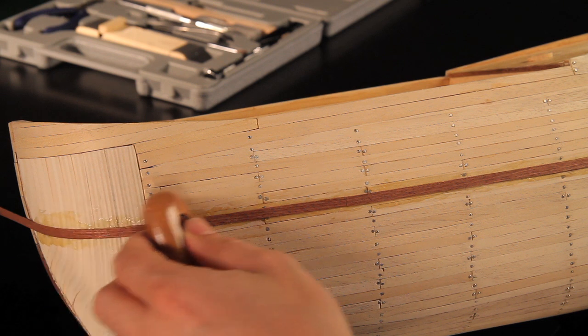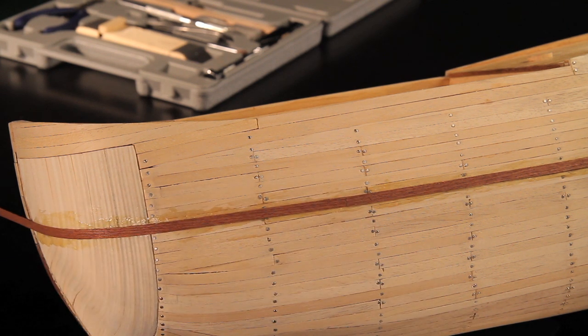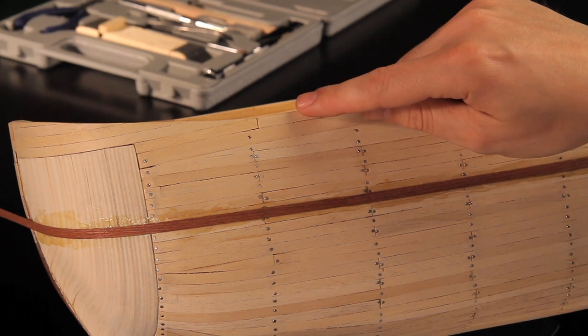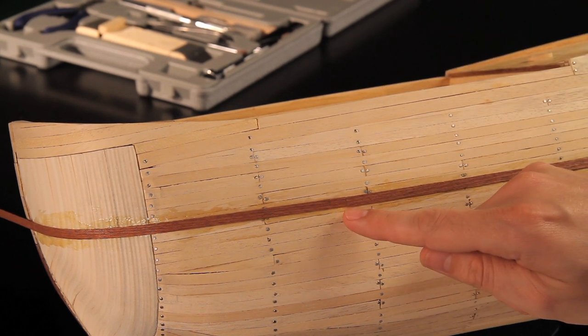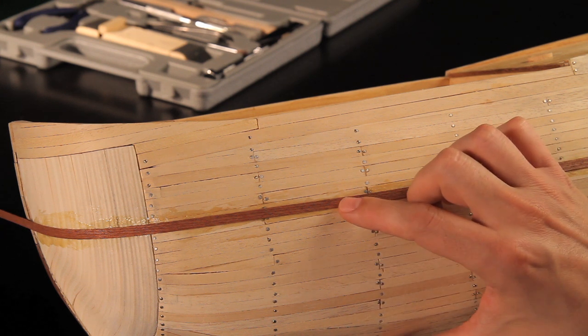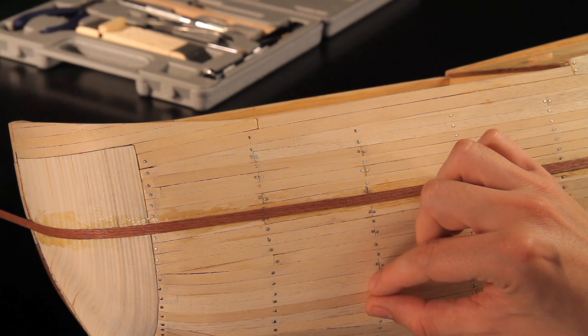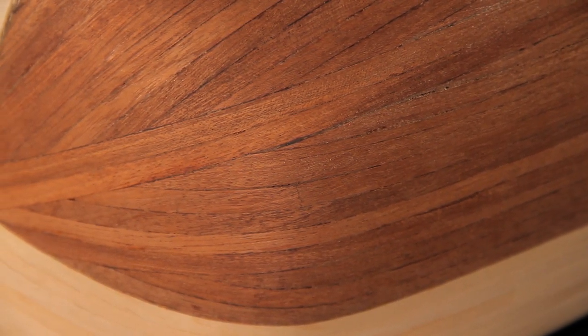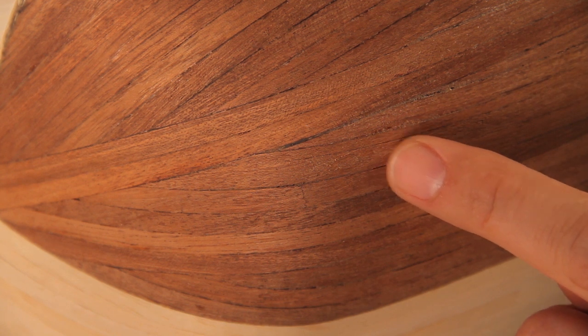Fitting the remaining pieces of planking is carried out in the same way as the first planking, from the first strake towards the upper part of the rails. In the lower part of the hull, fit the planking beginning from the start of the upper plank and from the false keel so as to end up approximately in the centre of the hull. The process of closing the gaps is also the same as for the first planking, by making and fitting packing strips.